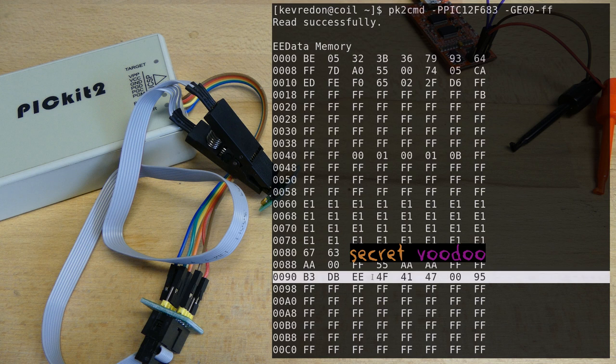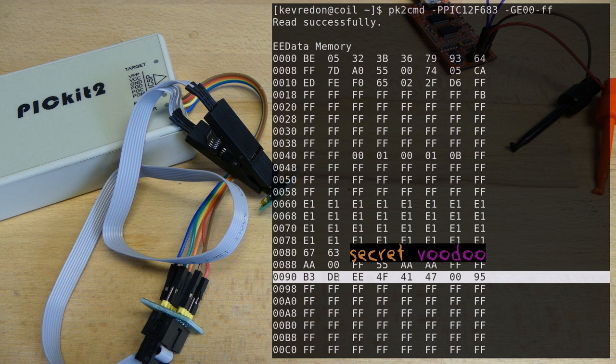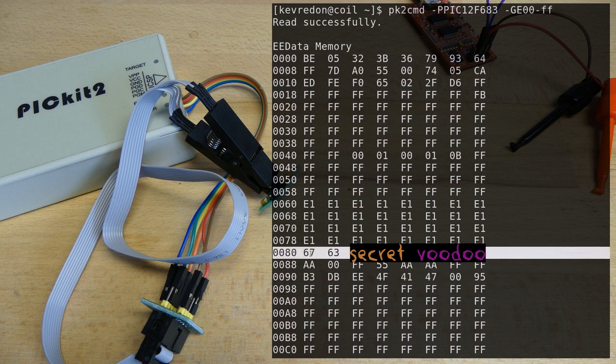This is a nice trick because this means that if you're cloning a chip, or if you're extracting the key out of this chip, you cannot just put it in another chip, because each of these DS2432 chips have their own IDs. So whatever you extract from one chip, you cannot simply put in another one. And this is also why they had to re-implement the whole stack and the whole DS2432 instead of just buying this chip. Because this way, they can actually burn or set the ROM ID from the one which they dumped the key from, and reuse the key which they dumped.